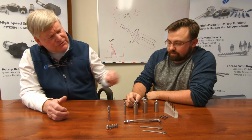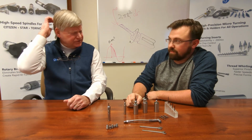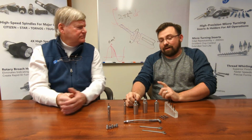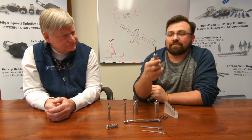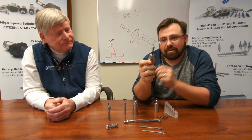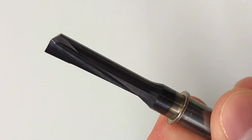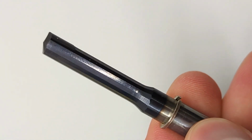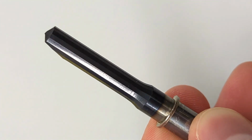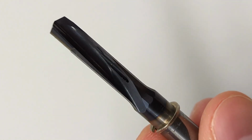All right. I also noticed there's something really unusual on the end of the bore bars here. Some interesting facets or round flats. I almost forgot about that. I'm really glad you pointed it out. So one of the real nice benefits of the microbore system is every single one of the bars, and I'll rotate it in the light so hopefully you can see it, has facets around the extension of the neck here, and every single one of them is a slightly different width. None of them are regular. And what that does is it breaks up any chance for harmonics to develop.